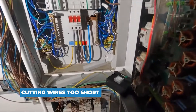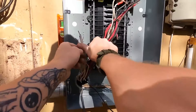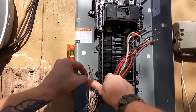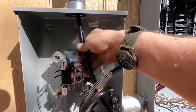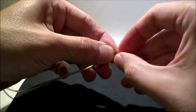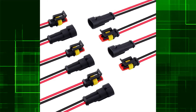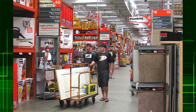Cutting wires too short. A common electrical wiring error is cutting wires too short. Too short wires can lead to poor connections. It's best to plan ahead of time to avoid this and to always plan on having too much rather than too little. Wires should protrude from the box by at least three inches. When a wire is cut too short, there is a simple solution: six-inch extensions can be added to existing wires. Wire connectors that are simple to install in tight spaces can be found at hardware stores and home improvement centers.